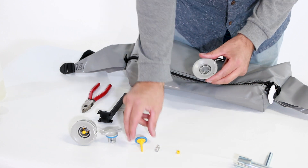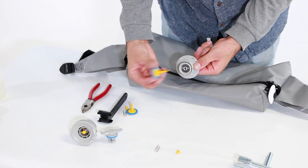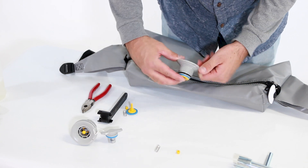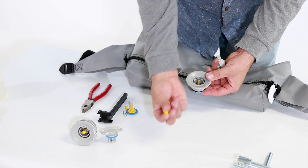The valve stem and spring can be removed from the opposite end of the valve. With your new components, line up and insert the new valve, slide the spring in place, then firmly press the yellow tip until you hear it snap in place on the valve stem.